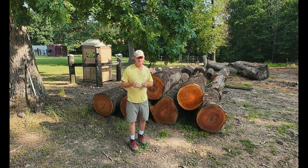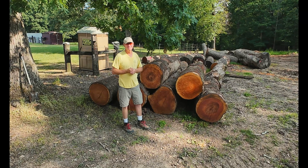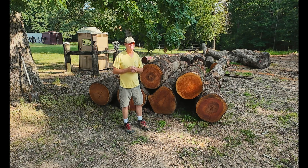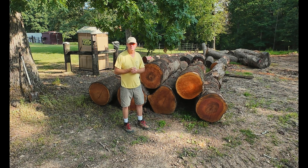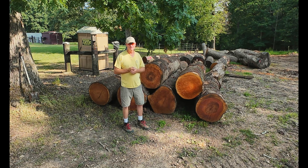Cherry generally has a lot of stress in it as a species. I guess it has a hard life — it's watching too much news, so it's always stressed up. Anytime you put a cherry log on a sawmill, you've got to realize it's going to have more stress than a normal log of a different species, so you really have to watch for that. I've put out a few videos on how to identify and solve or avoid stress.